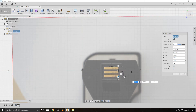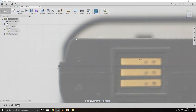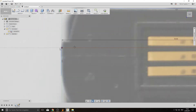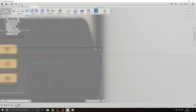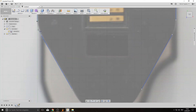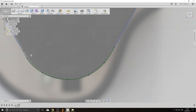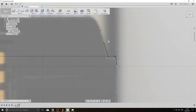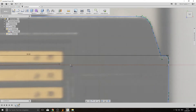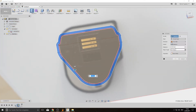I checked it and was pretty confident with the result. Then I started modeling the outer shape with lines. Besides the lines I also used splines, which help you to match round shapes and odd geometries in an easy and fast way. The last step was to make an offset of the outer geometry for a wall and then extrude the geometries to get the final part.